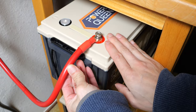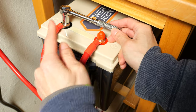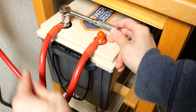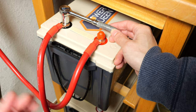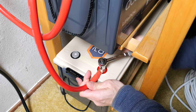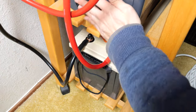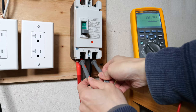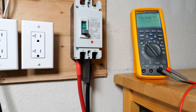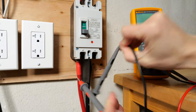The wire I'm using to connect to the battery is 2-gauge cable. Put on the cap, connect the other one. There's a question about whether to use a red or black wire for the connection between the two batteries — when you connect in series the other post is red, so I just picked a red cap on that one. All this time my breaker to the battery has been turned off. Now they're all tightened. Measuring the voltage coming out — making sure it's the right polarity: 26.38. The top battery is 13.192, and the bottom battery is 13.192, adding up to about 26.4.